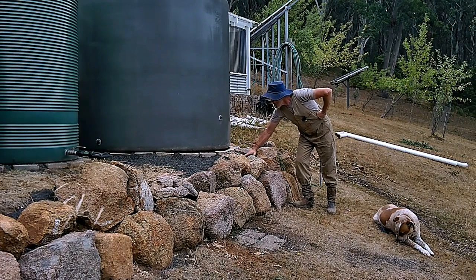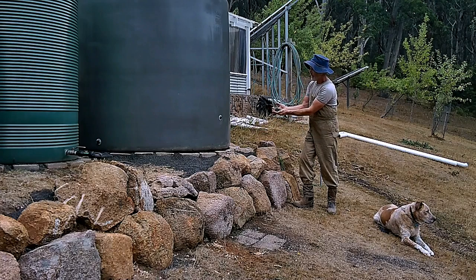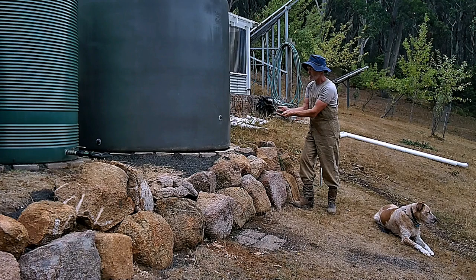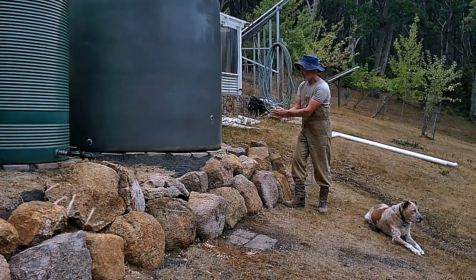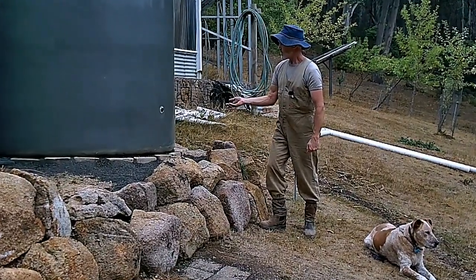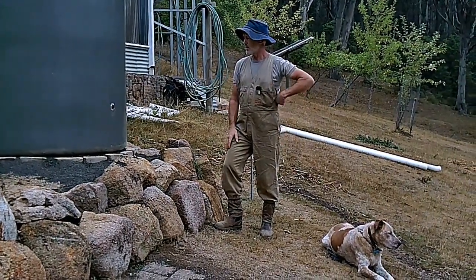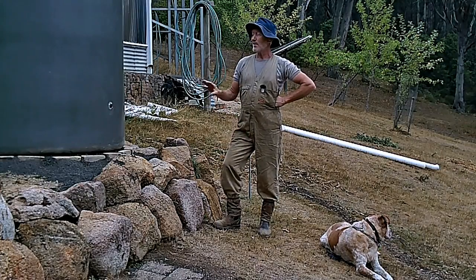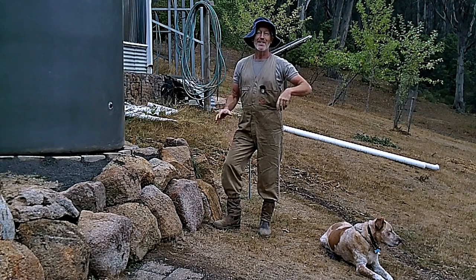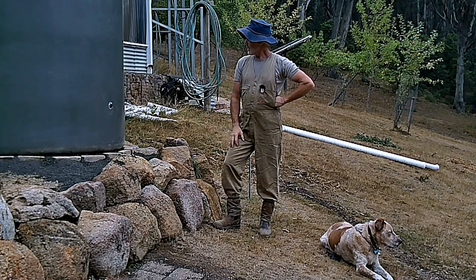Over the surface of the area we've backfilled it with rock crusher dust. In Australia, this is a waste product from quarries — really fine pieces of rock, bluestone or granite, apparently the same stuff as Stonehenge. It provides a nice flat base that compacts beautifully over time with no large chunks that could pierce the tanks. Because any leak will wash the soil away, so you have to be super careful.